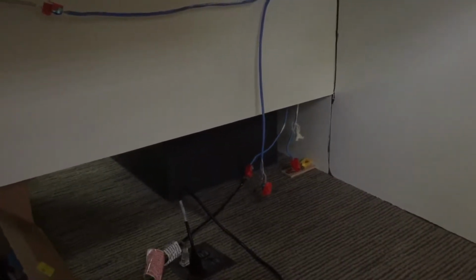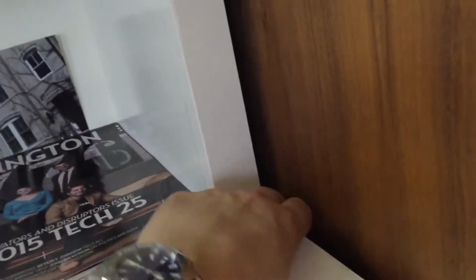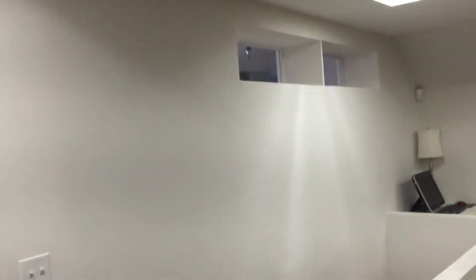These connections down here, as ghetto as they are, can get the full gigabit. So these are good connections, and as you can see, sort of, there's four lines there, and they're using like one of them. So somehow there's a hole there, and see if you can snake it through here and just mount it up on the wall there. I'm thinking put a 2702 there because I have one, and that'll get everyone in this room really well. Jeff Wilson sits here, and then there's a group that sits in that little office where those two windows are, and they'll have good reception. So anyway, that's the second floor. So let's go to the third floor.